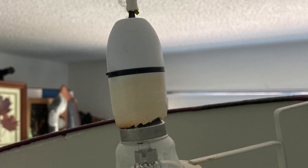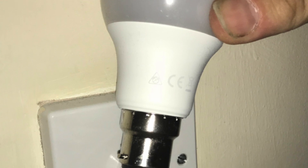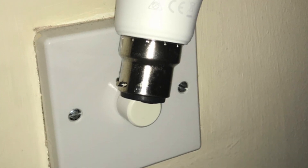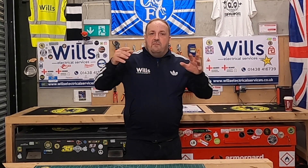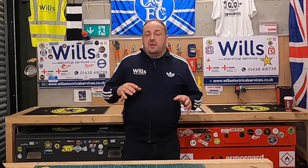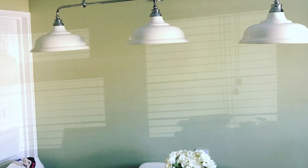Check the size of the lamps compared to the accessories — especially in older people's houses still with 100W lamps, when a lot of pendants are only rated at 60W, leading to a lot of thermal damage. Also with dimmers, a lot of people are unaware that LED lamps are not all dimmable. I had it once where I did a lighting rewire and the customer bought non-dimmable LED lamps — one started to smoke, but no damage was done.